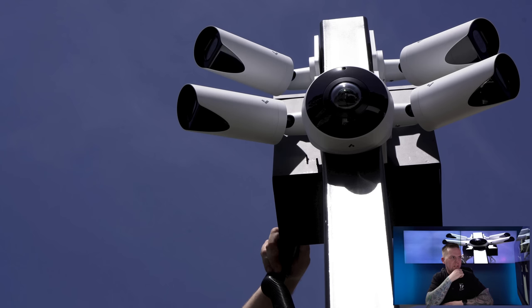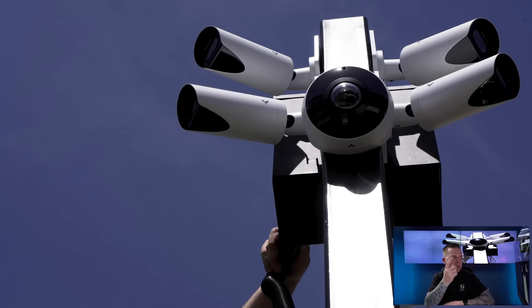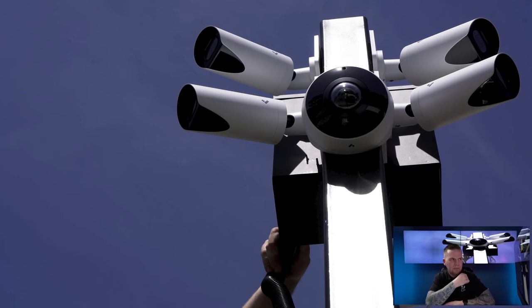For this setup we have five cameras: a CF-81 fisheye, two CB 4K 61 bullet cameras, and two CB 61 telephoto cameras for license plate reading. They all mount to a pole that's 12 feet in the air, 3 feet in the ground, with 12 inches of concrete around it — very solid. The electrician brought power in from the neighborhood's power junction box, and on the back we have a 12x12x6 junction box housing a PoE switch rated for high temperatures up to around 160°F and as low as about -10°F.